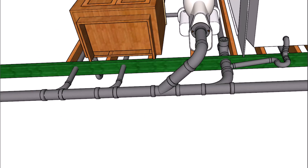Let's go ahead and take a look at the bottom side of the plumbing drain lines where we will be using a combo fitting here and a Y fitting here. This section from here to about here will be considered a wet vent, along with a view of the clean out here and the bathtub trap — inch and a half.